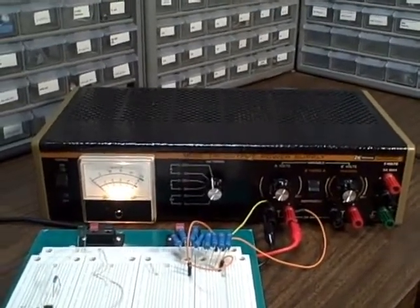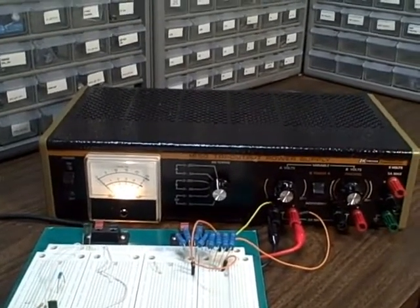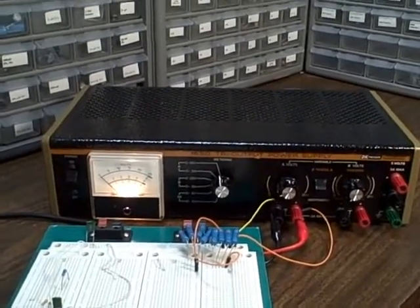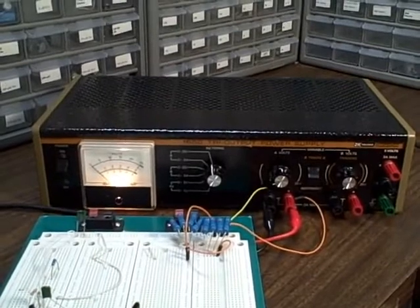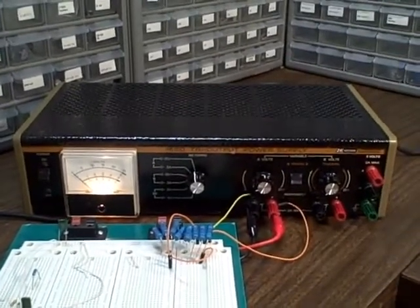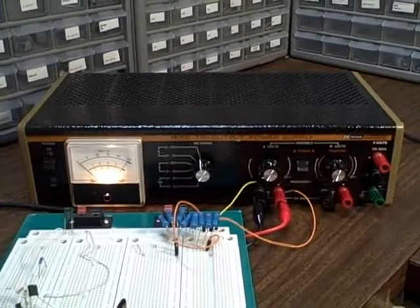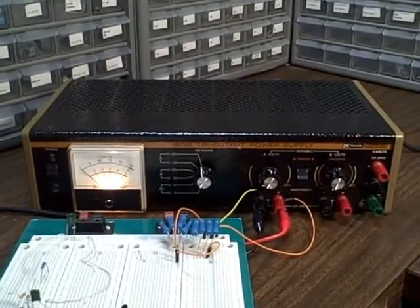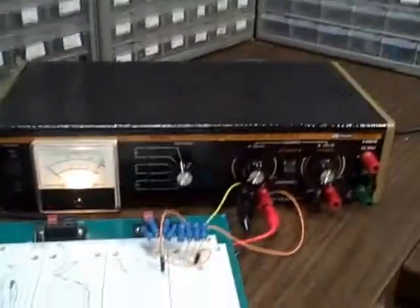You can track — you can make both A and B track together so that B will track A, so you adjust the voltage on A and B will follow. And you have foldback voltage and current protection, so if your current tries to exceed what you're capable of, the voltage will fold back and you'll protect the circuit and protect the power supply. And then as a third voltage, you have a steady 5-volt supply that provides up to 5 amperes of current, usable for TTL, ECL, or anything that could work off a 5-volt supply. 5 amps is more than adequate for normal breadboarding.